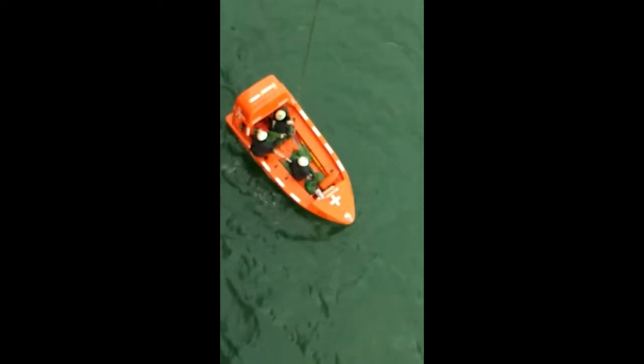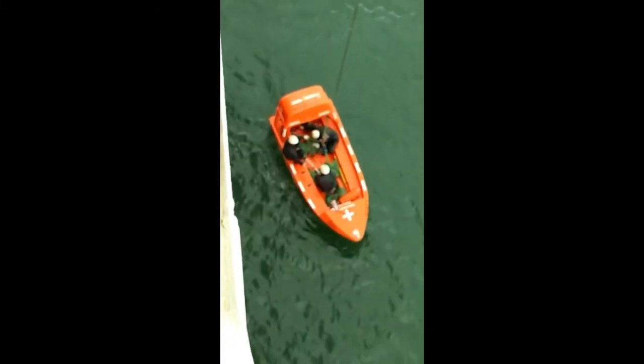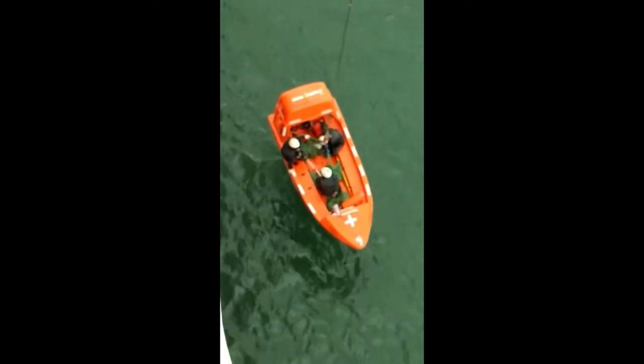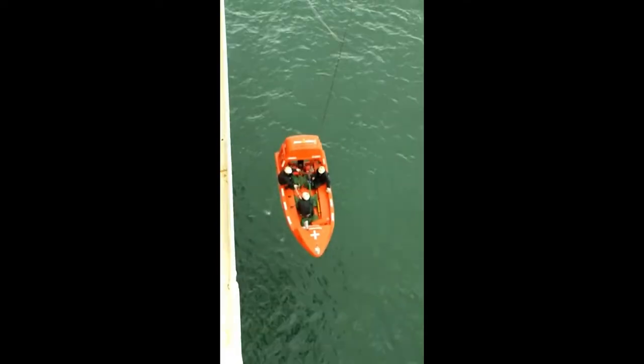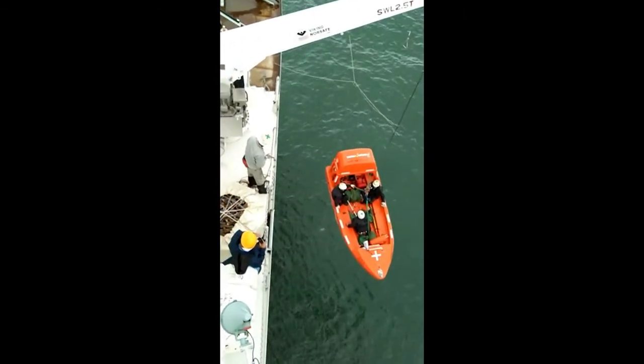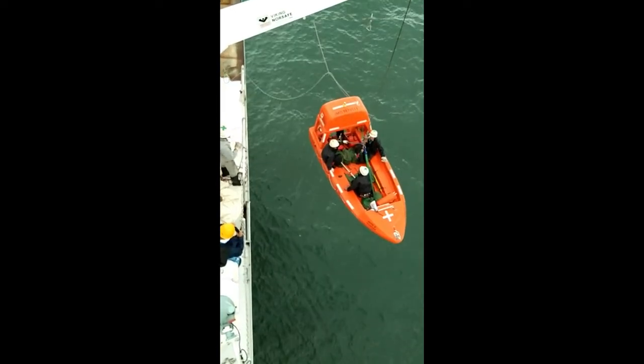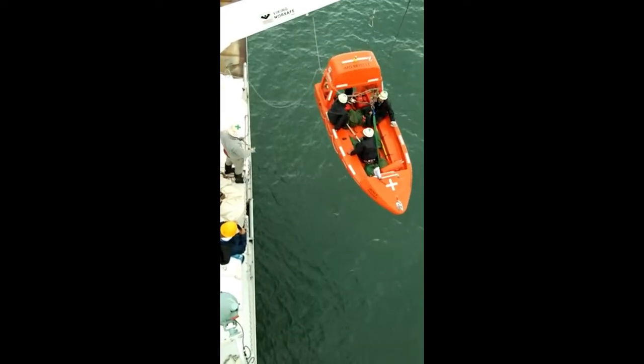Boat operating personnel should be familiar and well trained on how to reset the hook before attaching the line to the boat. If not properly done, then the hook might accidentally release the boat, and that will result in an accident. So it is vital that the operating crew are knowledgeable on how to do the job well to avoid any accident.